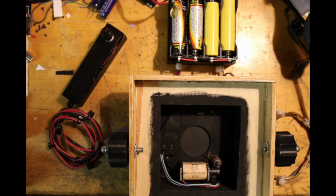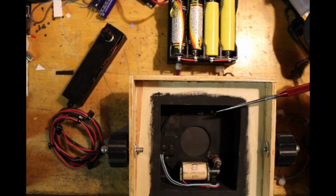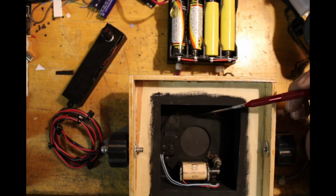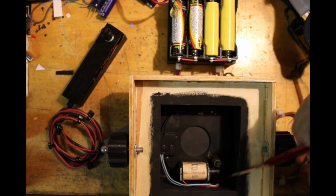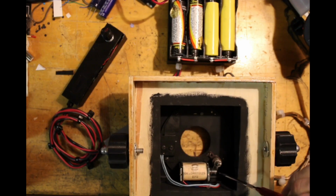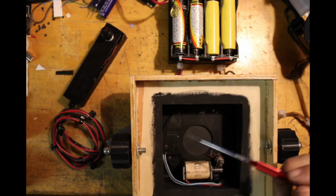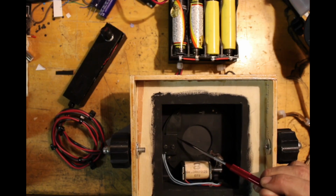This is the, as promised, shutter control system I was working on. As you can see here, I've already mounted in the front standard for my 8x10 the electromechanical shutter. It's actually functioned by the solenoid, and when it pulls back on this, it opens up that shutter for you real good. Then when it's fully open, it actuates the switch here, which makes an excellent flash sync.